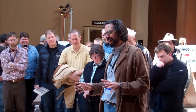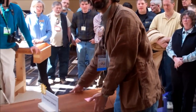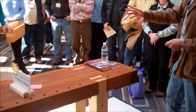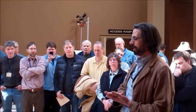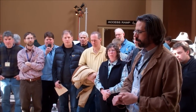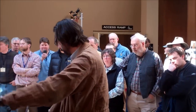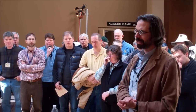Some of the other things that people ask me about with this bench: isn't it too shallow? It's only about 20 inches deep, and actually the older I get, the less I want a deep bench. Because with deep benches, I can't reach the wall where my tools are, or with narrow projects that I want to clamp to the bench, I'm limited because it's too deep. Plus it just takes up less footprint. I prefer longer benches. That way I can stick long molding in it in one stroke. So I'd rather have a longer, skinnier bench.